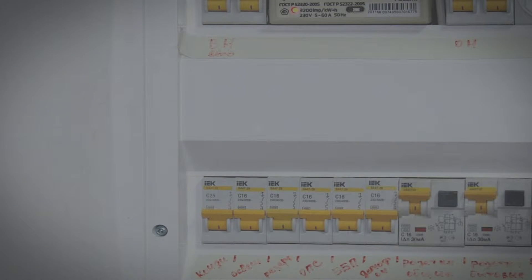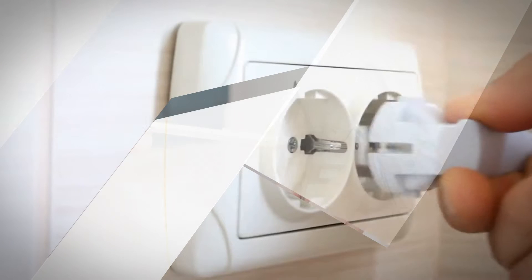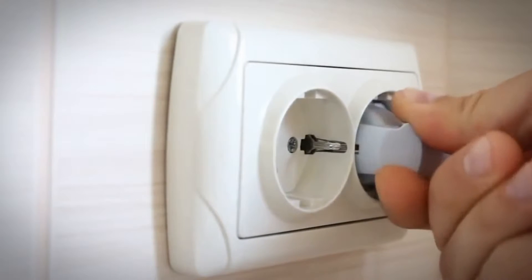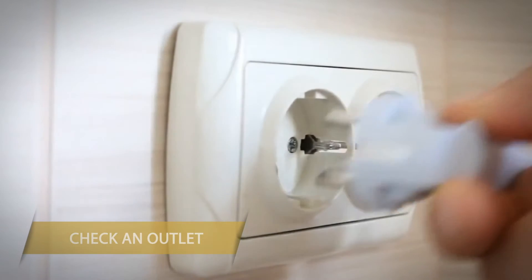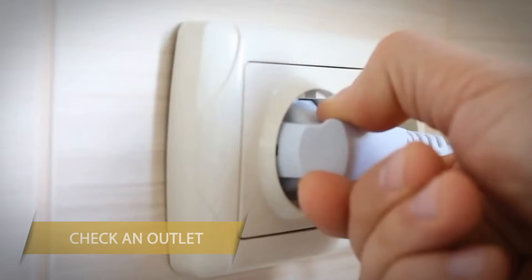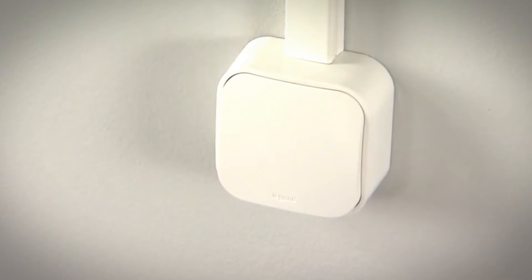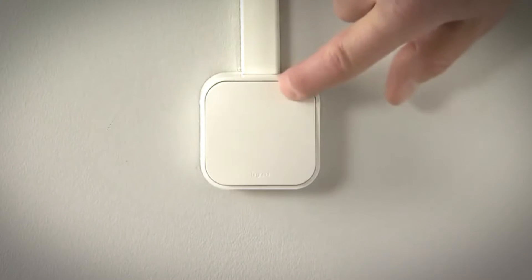In this video, we will examine common electrical problems and quick ways to fix them. If you plug something into an outlet and it doesn't work, first try plugging something else into the same location to see if that first item is broken or if that outlet isn't working. If there is no electricity coming from that outlet, check and see if that outlet is even switched on.